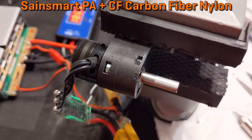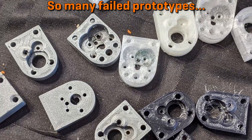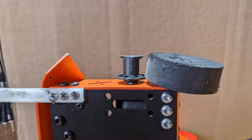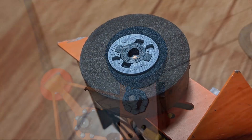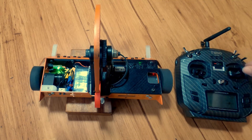In fact, they worked so well the forces they were putting on my PLA printed hubs were causing the washers to pop right off. So I redesigned those hubs as well, with a much tighter fit on the shafts — an adaptation of Fingertech's twist hub design. Originally I strayed from this due to the difficulty of getting the foam wheels on the hubs, but it also keeps the wheels on even without the washer attached at all.